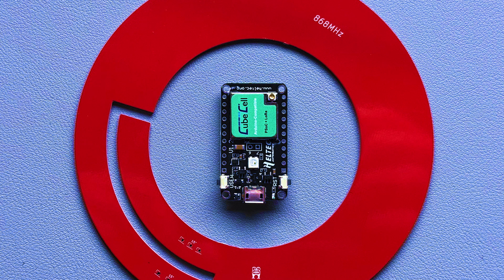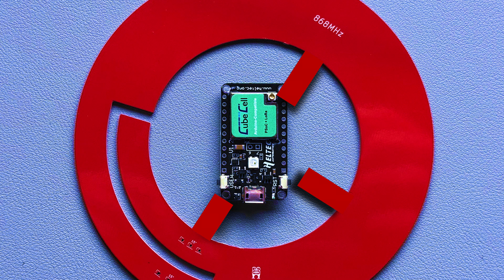Here is an important design tip. If you want to manufacture electronics and antenna on a single board, you should plan for large air gaps between the antenna and electronics. You could construct a bridge here, with the feed line on it. Then, place three more bridges symmetrically, so that the resonant frequencies of the two orthogonal modes remain the same.